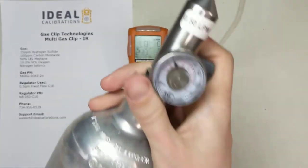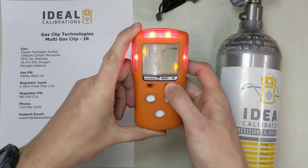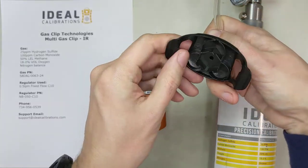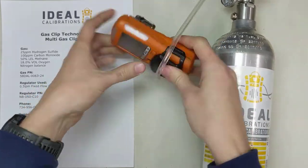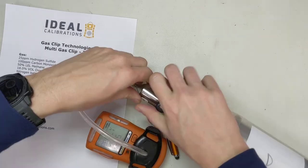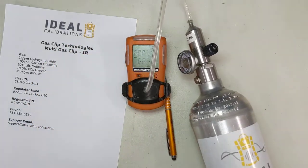Make sure you're careful. Now put this down — this is ready to go. We're going to put it into calibration mode by pressing and holding this button here. It's going to go off and then count down again and go into cal mode. Auto zero — release the button — and we'll get ready with our cal adapter. You'll see it has three slots here. Apply gas — we want the bottom one to go on the bottom there. Put it on — click. If you pull on it sometimes it comes off, so let's pop that on. Now we're going to apply gas. Open the valve, back off just a little. This will detect automatically when the gas is flowing, so we'll let that go ahead.